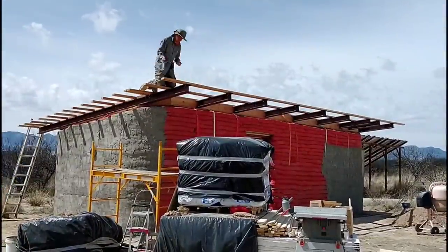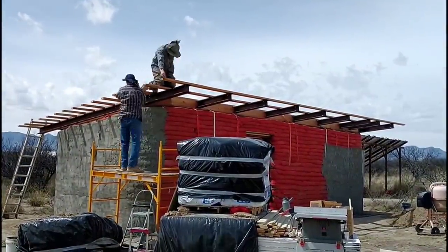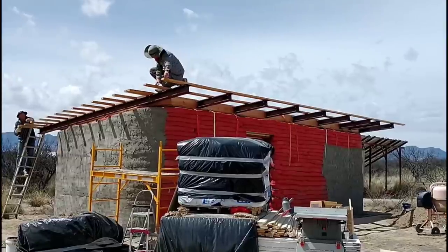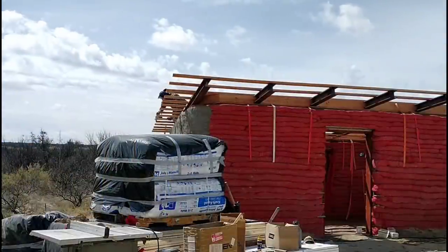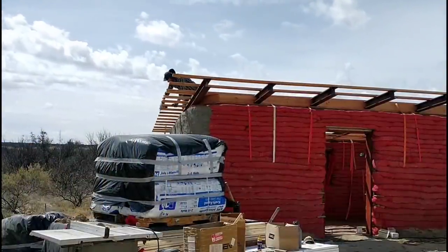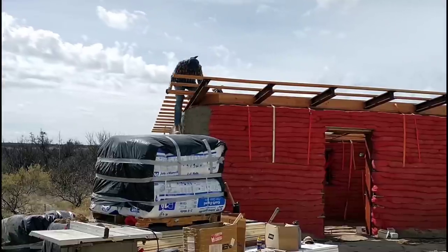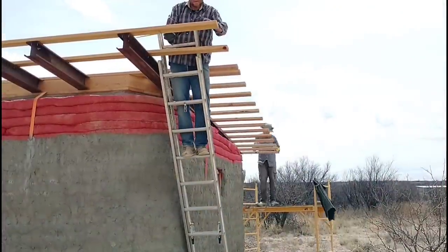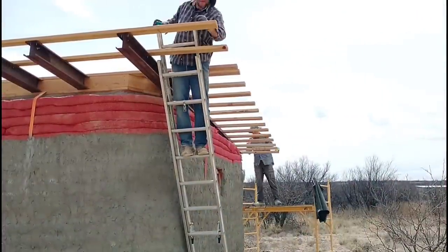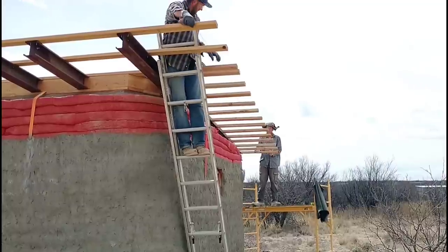It's the next day and Kyle and I are back at it. We've decided to go ahead and work on the eaves and try to finish them out before we start on the decking. We left the purlins long on each side with the intention of coming back, snapping a chalk line, and then cutting them all off straight and even with each other. That way we make sure we get a nice clean line for the eaves — we're leaving about a foot and a half sticking out off the side for the eaves, which will protect the wall from sun and rain.